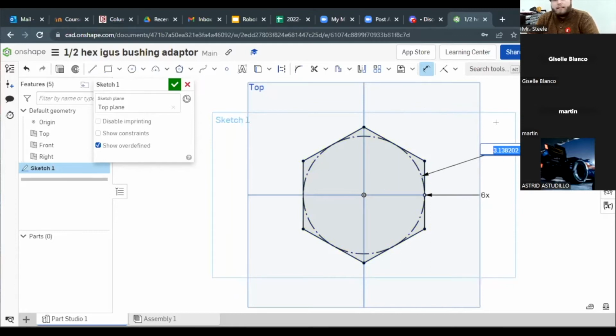And now that we've placed the label, we can now edit the label. The label, or the dimension, will automatically resize the object to exactly what size we type in. We can type in IN for inches, MM for millimeters, M for meters, CM for centimeters, and so on. It accepts math, it accepts decimals, and it accepts fractions.